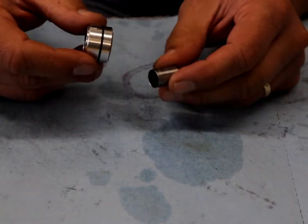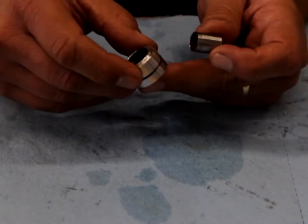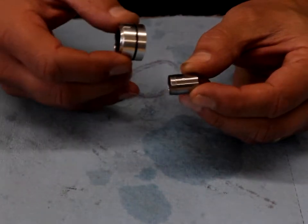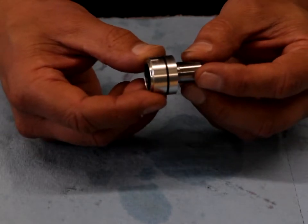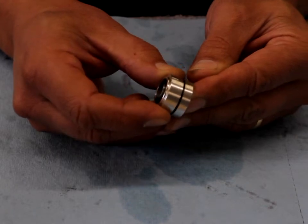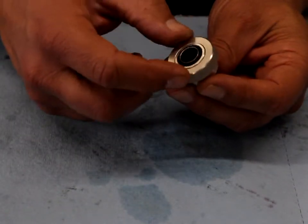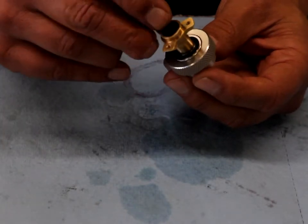Once that's done, we're ready to take the shaft guide. If you have a two-piece shaft guide, take it and slide it into the bottom of the clutch — that's the side where we just inserted the pin. Lead with the tapered end; there's an end with a slightly reduced diameter and we're going to stick that end in first from the bottom until that little reduced diameter pokes through the seal. Now we're ready to place the lock ring in the groove it fits and turns on, and then drop the shaft guide right in.